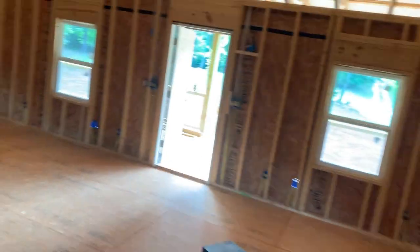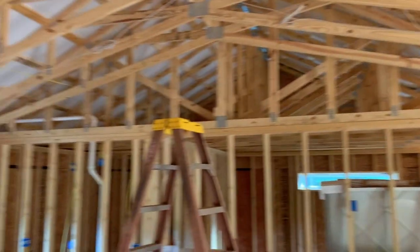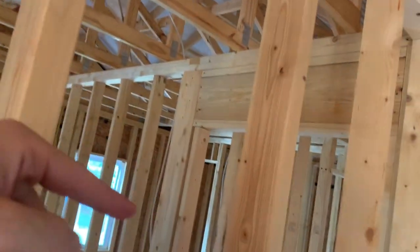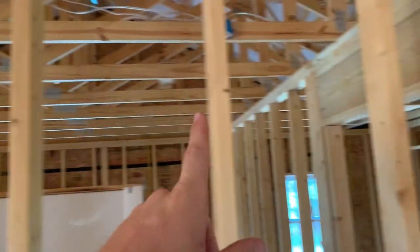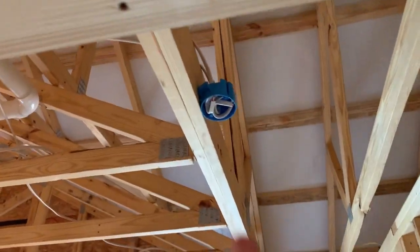so the spray foam guys can come in and do all that. So first off on the wire, after we got everything cleaned up, we did the smoke alarms. We started in this bedroom, and usually you just put one about 2 foot from the doorway. So we put one 2 foot out from the doorway there, from the power box to the doorway. And then from that one over, about 2 foot in front of this door in the bedroom.